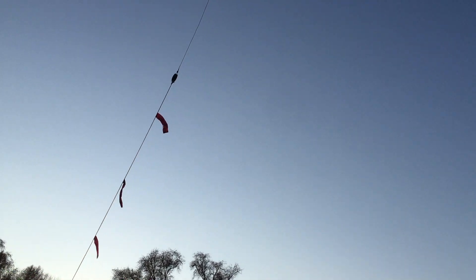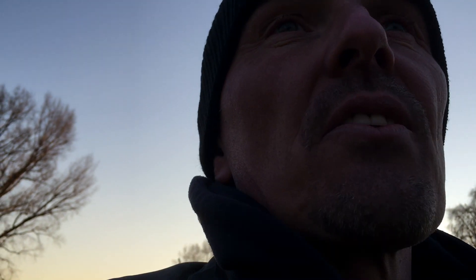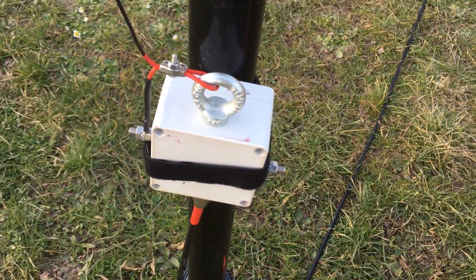Blanca doesn't have any insulation, so she is naked — that's why I called her Blanca. This one right here is 49:1, 67 feet of wire. Then I got a 9:1, 87 feet of wire, another 9:1, 33 feet, and another 9:1, 53.1 feet. I got a lot of antennas and they're all wire antennas, all made by uncle Joe, except my doublet — 300 ohms, 124-something feet.